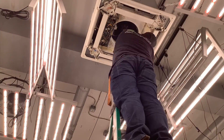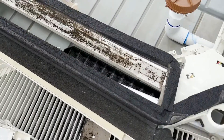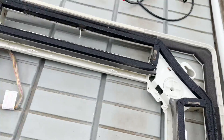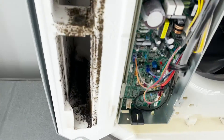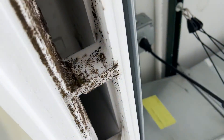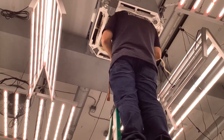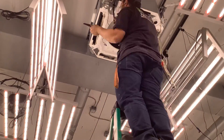These Mitsubishi cassettes are nice. You just wanna unwire the damper motors from the box, and then this whole piece comes out. These sit in these gaps — that is the air outlets. With that cover removed, now we can see a little bit better how they're working. Then you wanna unwire pretty much everything connected to this box, including the wires to the outdoor unit. That'll get your electrical panel out of the way and free you up to drop your drain pan.